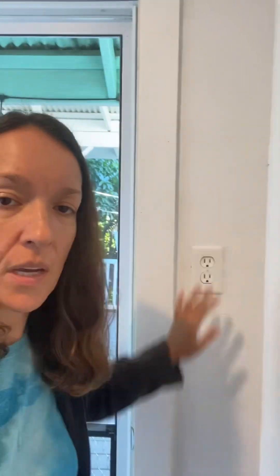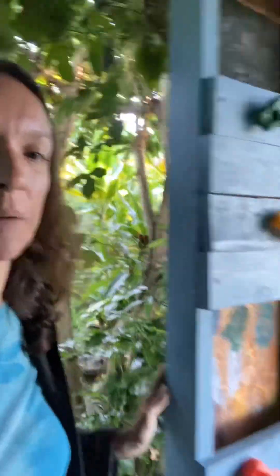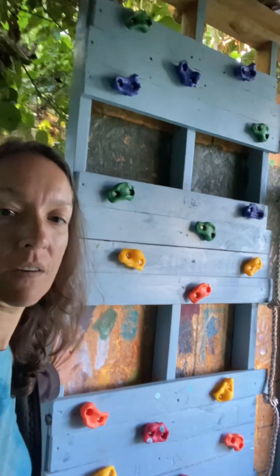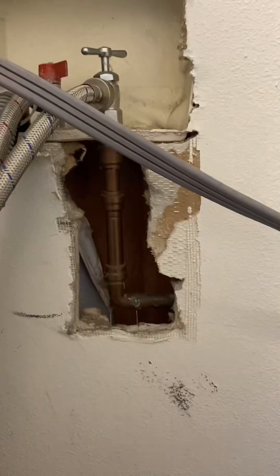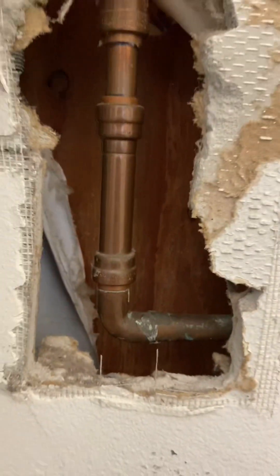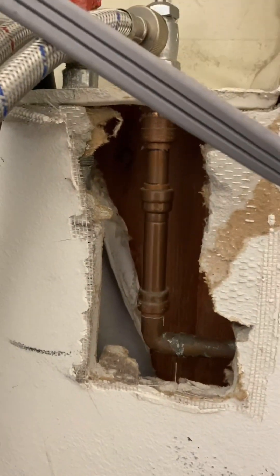What is a single wall house in Hawaii? Let me start with a double wall, or typical framing that you might find on a normal house. On a normal double wall house, you have an outside wall. Underneath the outside wall, you have typical stud framing, and then inside you have drywall on top of the studs. This is our treehouse, but it illustrates pretty well what typical framing would be. You can see the studs and the outer wall. In a normal house, you'd have drywall across here instead. A traditional house has drywall and then an outer wall, and in between there are studs — a great space for plumbing, electrical, and insulation, which we don't really have much of in Hawaii.